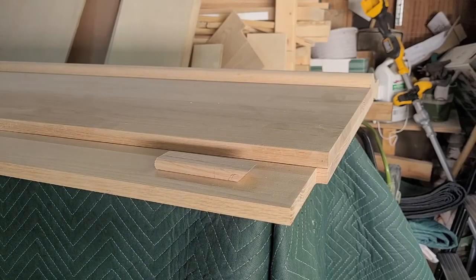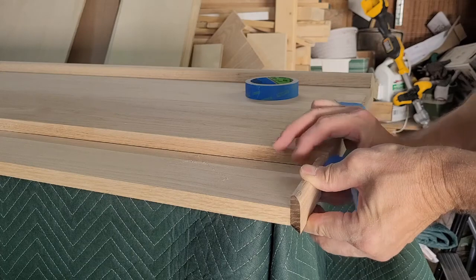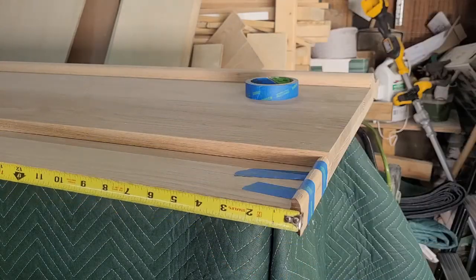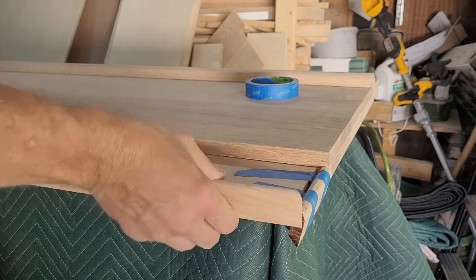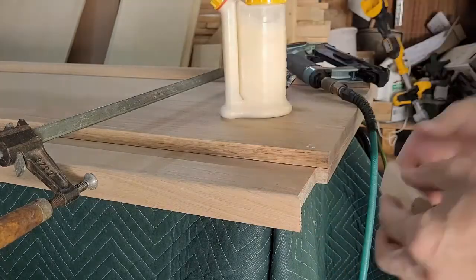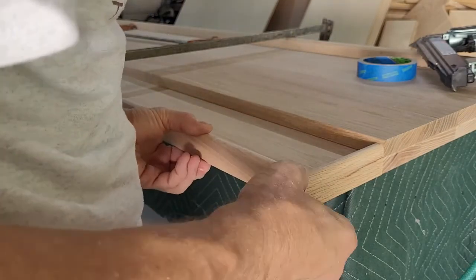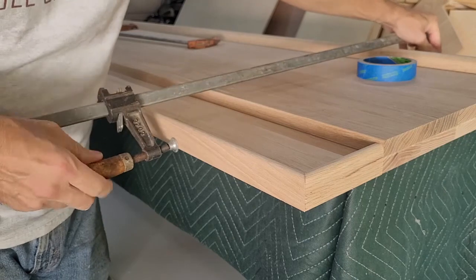Once the glue was dry and after a bit of sanding, it was time to connect the bar rail to the top. I set the rail on the top, used a couple of clamps to hold it in place, then drilled through the holes in the top up into the rail, and fastened the two together with number 8 by inch-and-a-half screws, working my way down the length of the rail and around the corner. Back to the drip edge on the glass rail — for trim like this where there's one square end, I like to start with a clean miter and cut the stock to size by trimming the square end. With the short piece of drip edge cut to length, I taped it in place and measured the distance to the bar rail on the opposite end, sneaking up on my length at the miter saw. A little glue and a few 23-gauge pin nails held the small drip edge in place. The long drip edge went on the same way with clamps to hold it while pinning; it had a little twist but I got it in place and clamped until the glue dried.